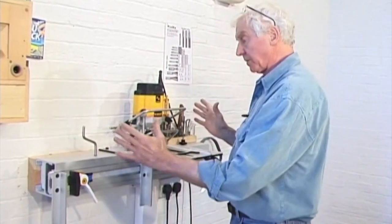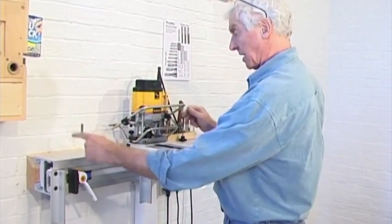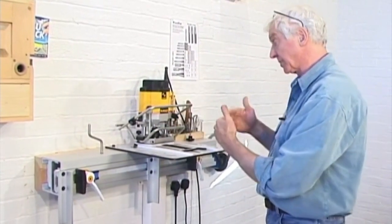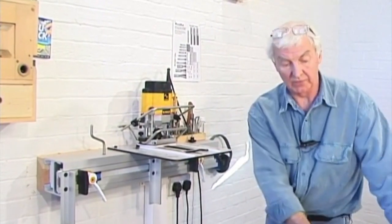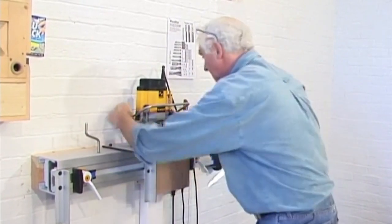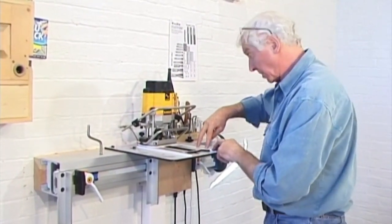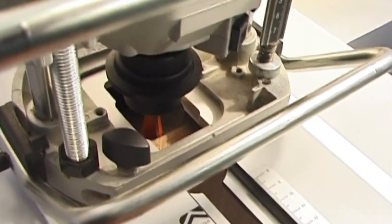At the beginning of all this, we had the east-west registration with the cutter and the mark and the two fixed fences. Now, we can move this around to act north-south if we have the cutter and the wood brought together. And we now need a picture of the wood and a picture of the cutter. There's the real cutter at the back of the real wood.